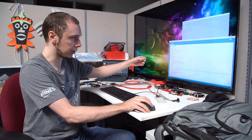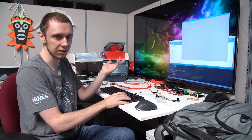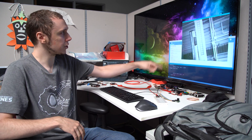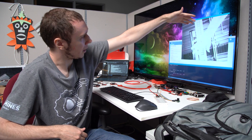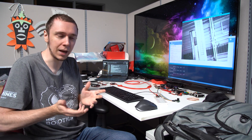I'll go ahead and run this script and bring up this serial monitor here. You can see it's currently asking me to select a resolution — there are a few options I've configured this example for. I'm going to choose the biggest resolution, which is 1280x960, and in a moment you'll see it grab that image and display it on my screen. It's currently shooting up at the ceiling. If I put my hand over this, you can see there's my hand. It's running about three seconds per frame, and most of that is actually just a communication bottleneck over the SPI interface and USB.